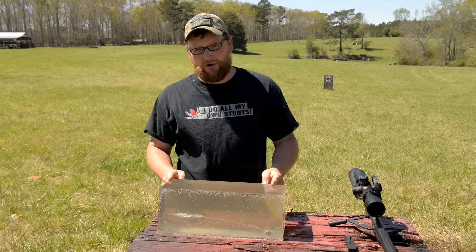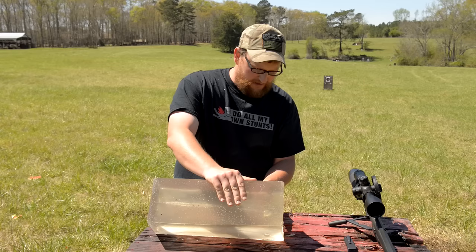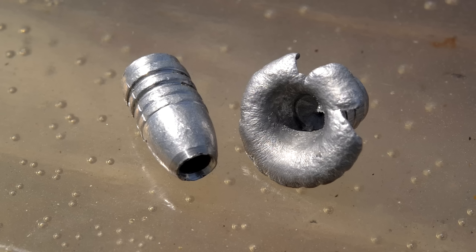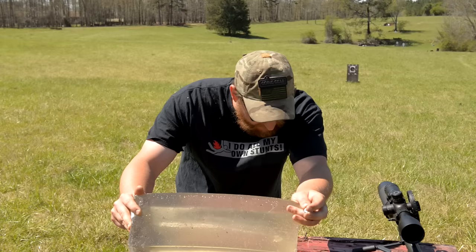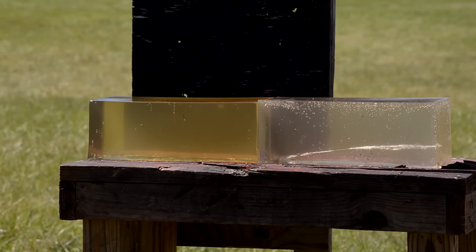That sounded scary — let's have a look. I'm very impressed with my little mad max projectile — previously a 350-grain, hollowed out to 290 grains with a simple cavity on the lathe. The performance is very impressive: a very nasty temporary cavity within the first eight or nine inches of gel, good permanent cavitation, then it dipped low and ended up penetrating a total of about 14 and a half inches of ballistic gelatin. That pure lead just really mushroomed out — looks like we have around 95% or more weight retention.